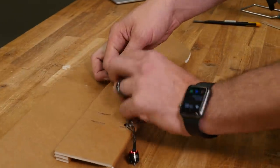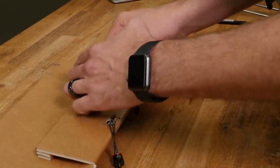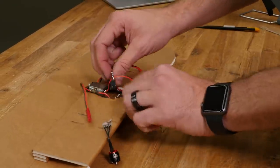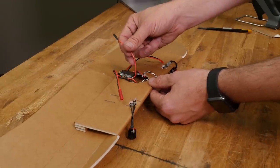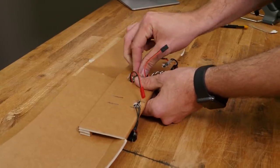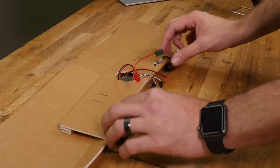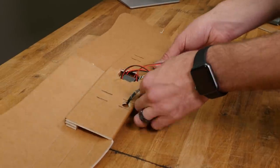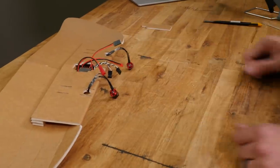Before building in the cells, get our power distribution board and all the wires in order. We should see our accessory support if needed, two signal wires from the ESCs, and the power wire for the receiver. Once we're happy, tuck this down in and eventually glue it in place. Then pull the two motors through these two notches and set the wing aside while we build our engine nacelles.